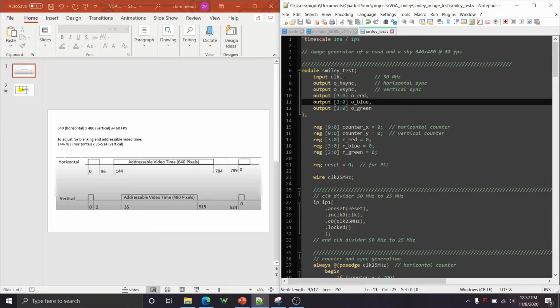I have my port declarations up here. So I have clock, the horizontal sync, the vertical sync, and the output red, output blue, and output green. The module is called Smiley Test. This code will be linked in the description, a link to my GitHub. It's called Smiley Test because I'm going to be using it for something else later that I'll make a video on as well. Note that my input clock is 50 megahertz, while what we actually need is 25 megahertz, and we'll talk about that later. So if your clock is different than 25 megahertz, don't worry about it. We can talk about it later.